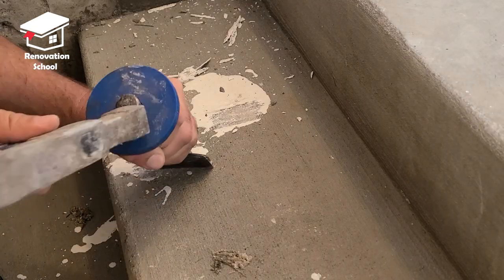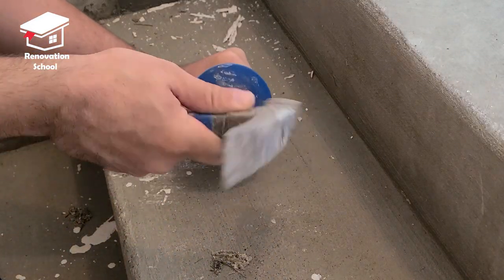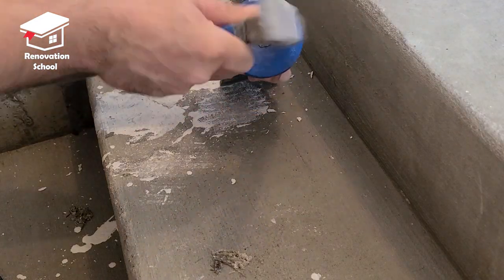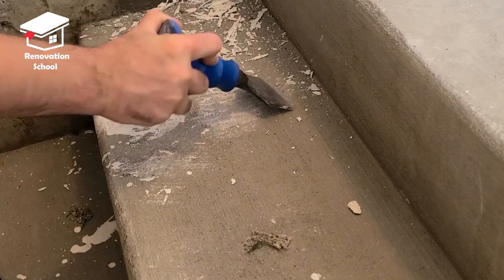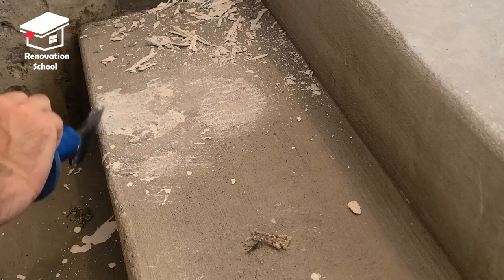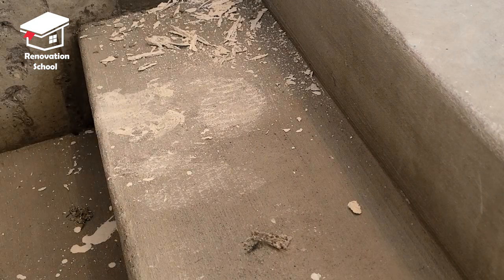On this spot I had some dried paint sitting on top of one of the stairs at the very end of the garage. I grabbed the same masonry chisel, hit it with a hammer, and tried to remove as much dried-up paint as I could. The goal is to remove as much as you can — you may not get it all, but do your absolute best to get it down to bare concrete.